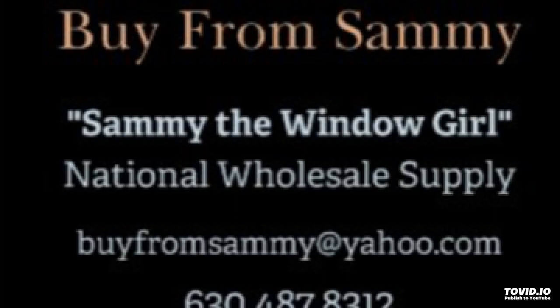I do projects all over the United States. People call me as a consultant to work on one project at a time with them. I just did a historical project in Pennsylvania and worked on that for 18 months. I do historical window applications as well. I like factory mulled because it saves a lot of time and energy and it has accuracy. When windows are made at the manufacturing plant, they're made on a squaring table, and the third window sometimes has to be field mulled, which means the window installer has to do it on the job site.